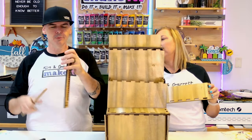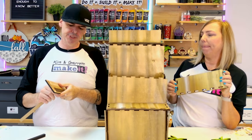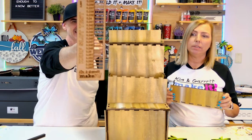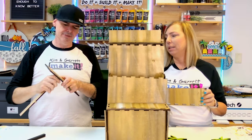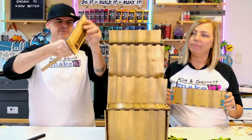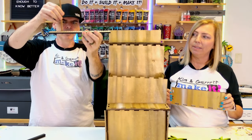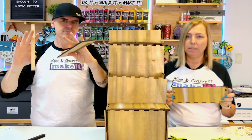Show how you measured it — you put it right in with the calipers. Now I can push it in. So 0.25 on this little kerfing tool — it's tight. Too tight to put together and take apart on a regular basis. So I'm just going to jump down to 0.253. It feels kind of loose at first but I can get it in — it feels snug and tight. It will hold on but I can still pull it out with two fingers. And it should give us a little room for a coat of paint.